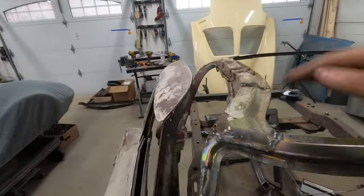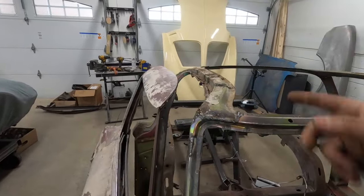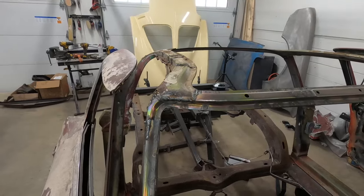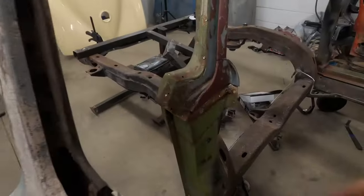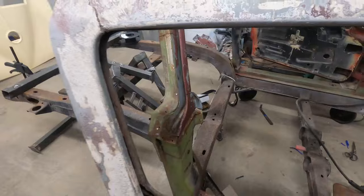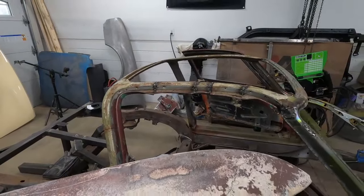You can see I had to manipulate these gutters quite a bit. I'm going to come in here either with the air hammer and blast them out, or drill and grind out the spot welds. We'll remove all the gutters and I have a whole brand new set we can start fitting in. I'll have to inspect these because they actually look like they're in pretty decent shape, so I'll have to figure out what to do about that. But overall everything looks like it's in really nice shape.